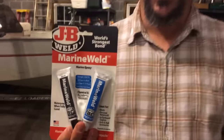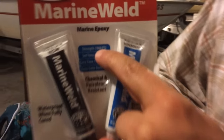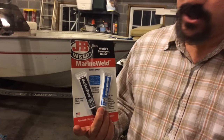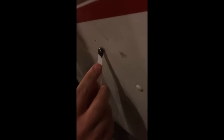The next step is to add — I like to use JB Weld Marine Weld. They do make a putty that you can buy and mix together, but I prefer this. The reason why is because the PSI strength is at 3,960. If you get the other product that JB Weld makes, the PSI is not as high. So this is going to last a little bit longer on your aluminum boat. Take each of the two tubes they give you in equal parts, 50-50, and mix the two together. Take your mixed putty and simply fill in your holes. When you're done, you should have little gray spots — the black and white tubes mix up. Go ahead and sand those when you're done, and you're ready to go.